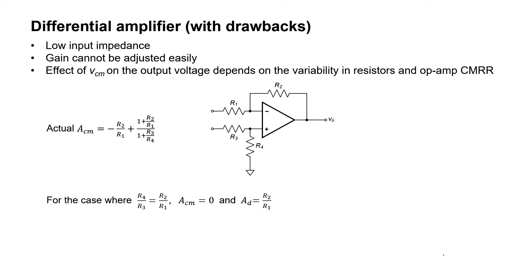We eliminate several of the drawbacks with a simpler differential amplifier that I analyzed in the last video. Let's review that simpler differential amplifier. It had three drawbacks. First of all, it had an input impedance that was lower than it could be. We're not looking directly into the pins of an op-amp; rather, we're looking through resistors, some of which are connected to ground. Therefore, the input impedance is not as high as it otherwise could be. That's drawback number one, and we're going to eliminate that particular drawback in this video.